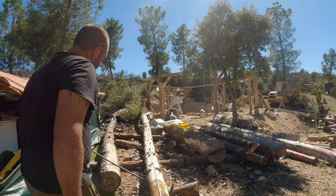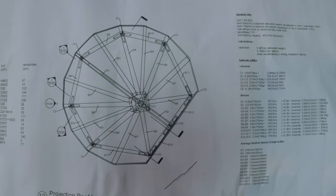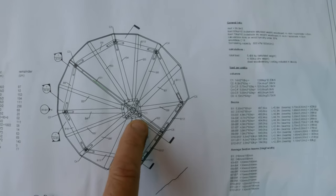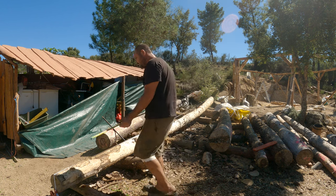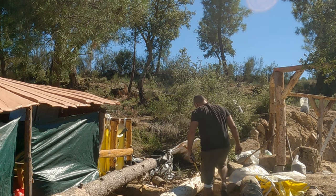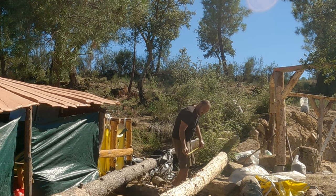Four centimeters. It's not too bad. It's pretty much going down the middle, which is kind of good news. From the outer columns to the center point of the center column is about 5 meters. And then from there to the back is 228. So I've got like 72 difference. I think we'll put an overhang of 50 on this side. So just to get a basic idea, 50, and then 228 from here.